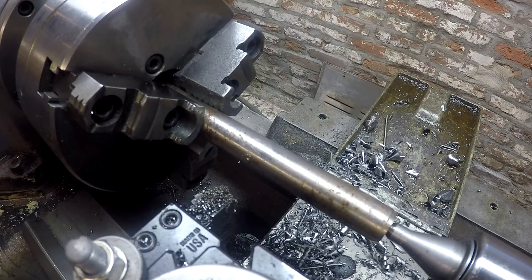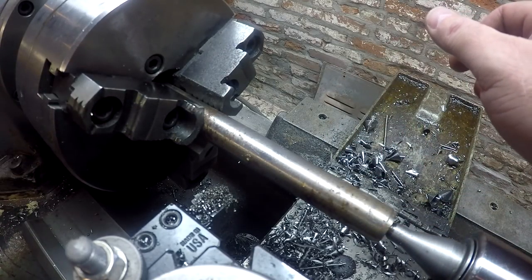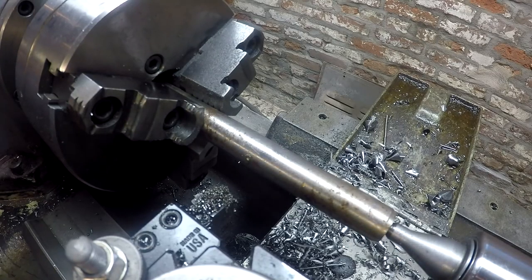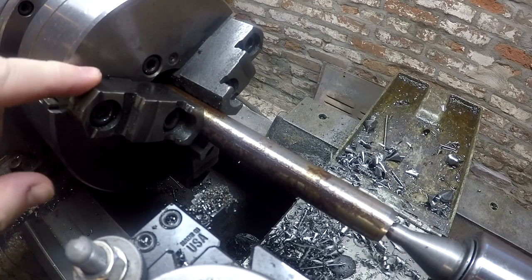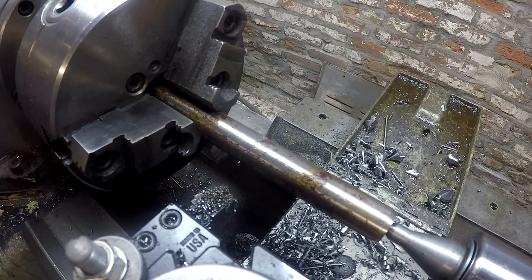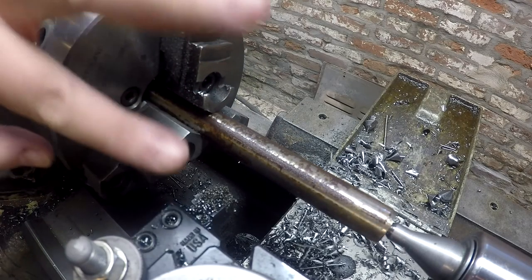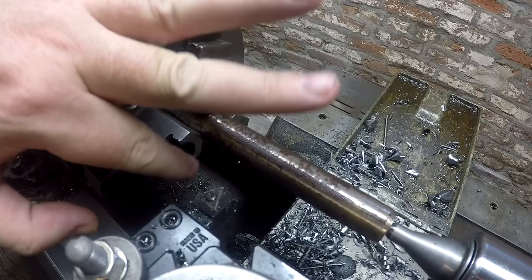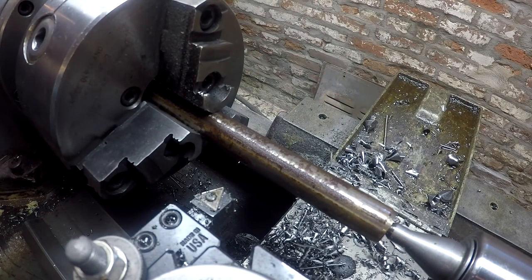All right, I'm working on the bushings right here, and I got some off-cut. I believe it's off-cut 1144, or Stress-Proof to you Europeans there, that I'm going to use for these bushings. The bushings don't have to go the full length of the part. The bushings only extend to within an inch of the end of the part. So 3.5 inches on the bushing, 3.3 actually, is plenty.